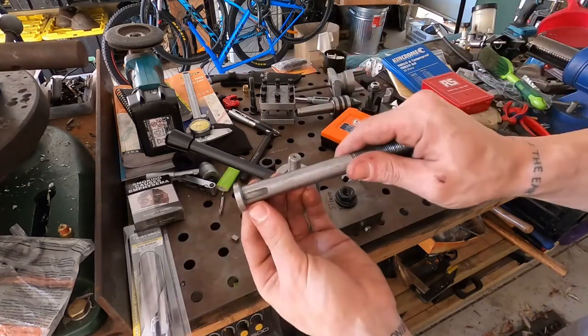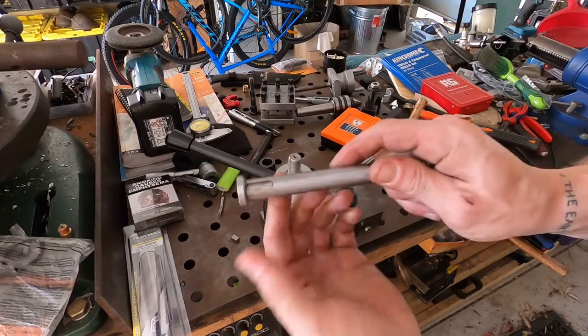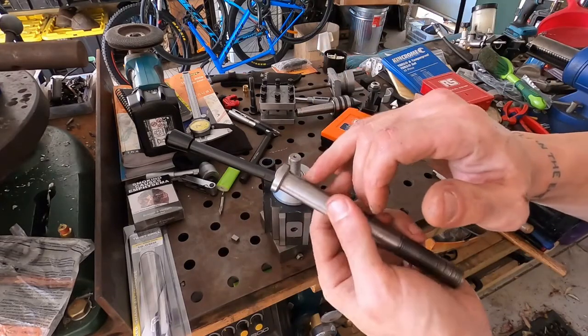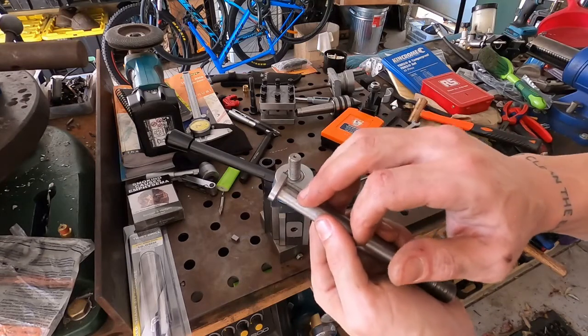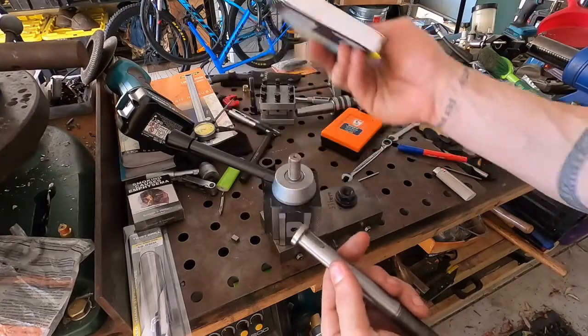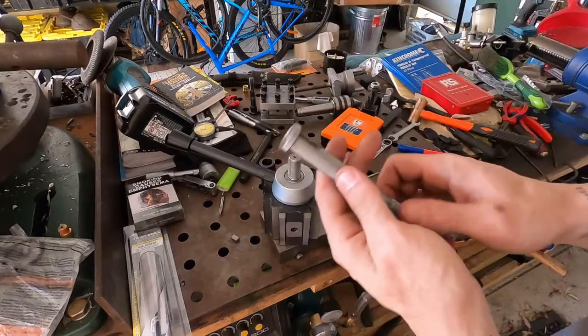As far as the keyway goes, this is what I did in the first one — a 6mm key. I didn't calculate anything from the book because why do it properly when you can do it half-arsed. But it was enough. Half the key slots in there and then into the compound as well. What we're going to do next is put that same keyway in this new stud.